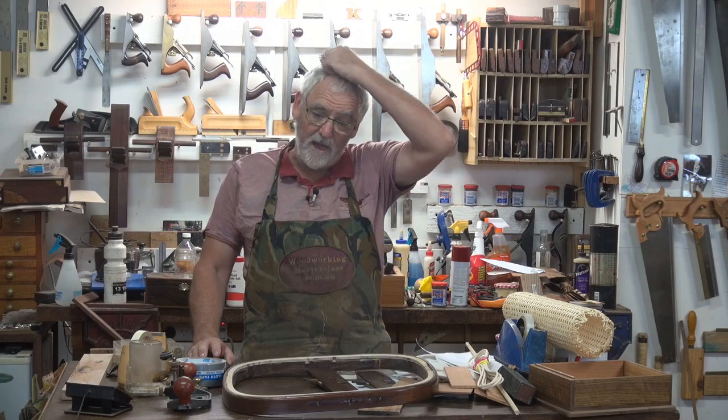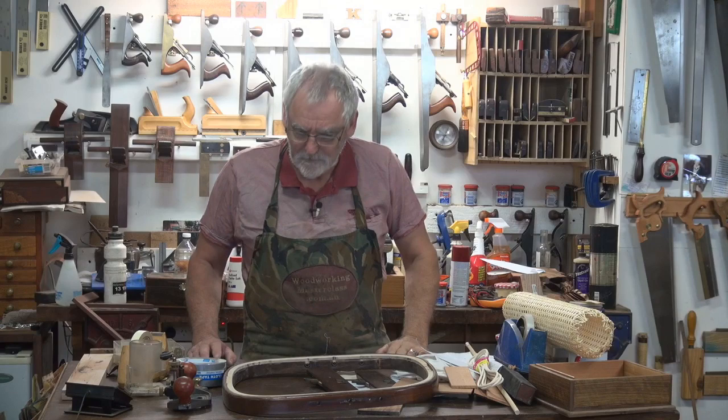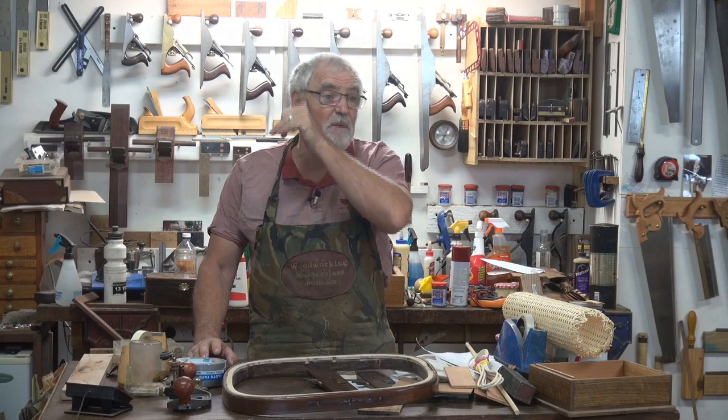Look, yeah, I'll show you a little bit later on, Devon. If you're using it for smoothing, you just round them off. I'll show you how to do it on the blade itself. Is that what you're talking about, the corners of a new plane iron? Yes. For smoothing, you don't get those tram tracks, because otherwise you have to be dead on, spot on with the laterals if you've got sharp corners.